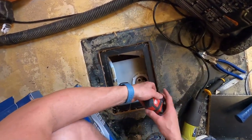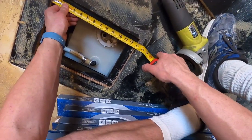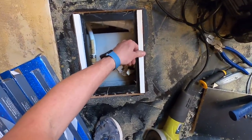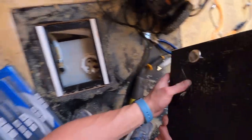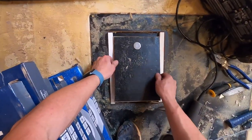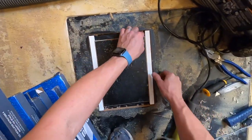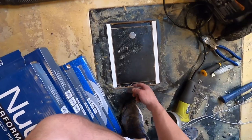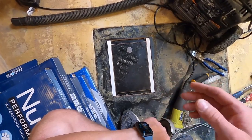Now I'm going to cut those pieces of three-quarters I ripped at my house and see if they work. Going twelve and three-quarters and twelve and three-quarters. Let's see if it fits. Oh yeah — that's going to be really, really good. It feels more even. I'll finish nail it and then I'll be able to cut off the ends or knock them up underneath. I have inch-and-a-half brads, so it should be almost through. I'll cut this one at eight and a quarter, and this will work out pretty well.